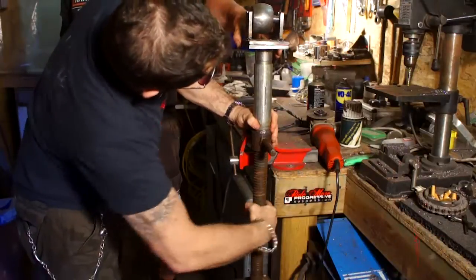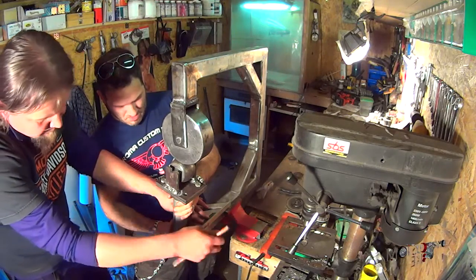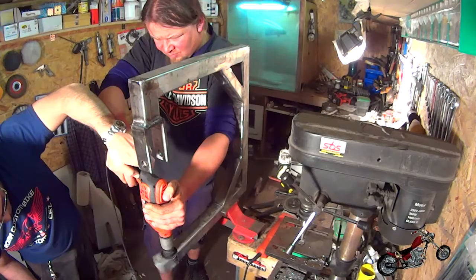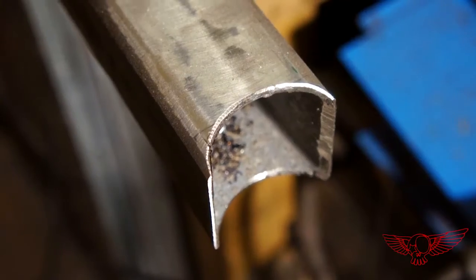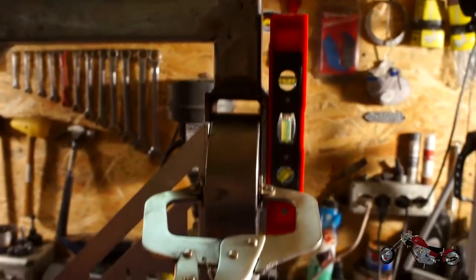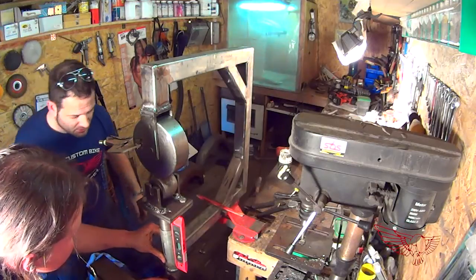One more test and everything seems to be working fine. Now we have to find where to join the cylinder to the frame. We mark the spot and proceed to cutting the tube using a cut insert on a hand drill. We try to be extra careful to drive the drill as perpendicular as possible to the horizontal plate. Janus cleans up the cut with the grinder and we realize that we made the cut a little bit off center, but that's not a big deal — we can still fix it by filling one side with the final weld. Now we can tackle the very delicate process of aligning the wheel. We have a little play with the coupling system we made, but precision is still very important at this time. We place the level in a lot of different places to verify that everything is aligned properly before we start to weld the cylinder to the frame.